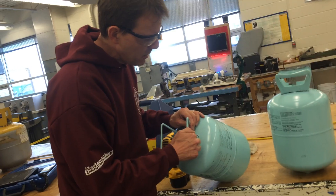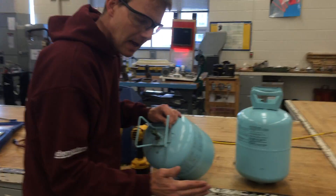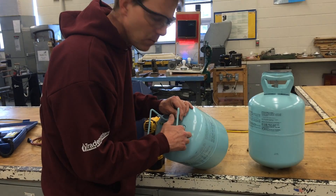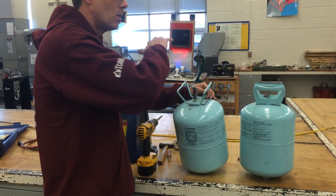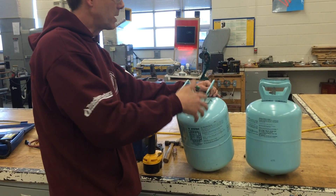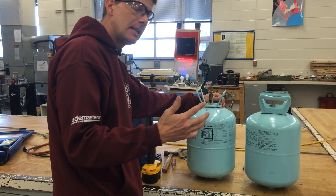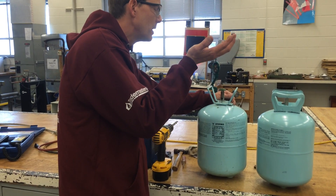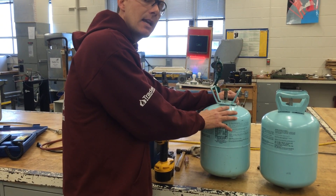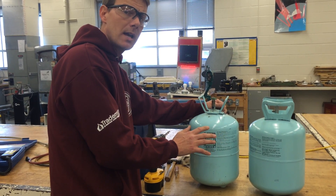I could also pop the safety plug. That safety plug on most of them is set to blow somewhere between 350 and 500 psi. I've actually seen one of these blow before, and when it does blow, it encompasses the whole area with liquid refrigerant — liquid, vapor, all refrigerant flies out. Because it's heavier than air and displaces oxygen, it goes to the ground first and fills up from the ground up, which means you should vacate and ventilate. Just get out, and when you leave, leave the door open on the way out.